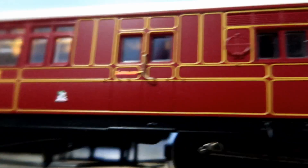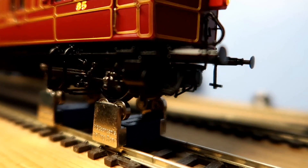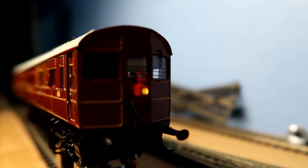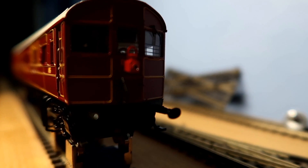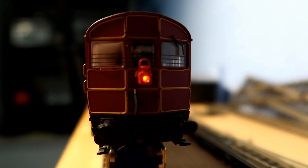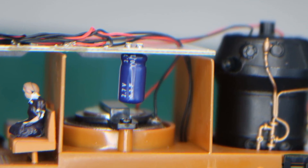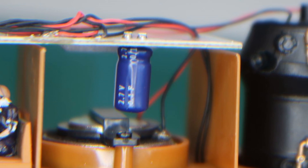However, there are other factors that need to be considered here. Because I have reduced the current draw on the UB+ pad 3V supply, there is more current for the coach lighting units, which now glow far more visibly, as well as demonstrating the stay-alive function I brought to your attention some time back. My only concern here is that for some reason the stay-alive anti-flicker capacitor is only rated at 2.7V, but at 100,000uF — shown as 0.1F on the can — an incredibly large storage value. At 2.7V this is very near to the 3V supply; however there is R14 to protect this, I guess.